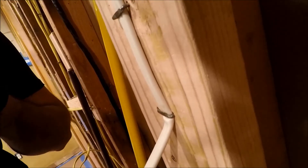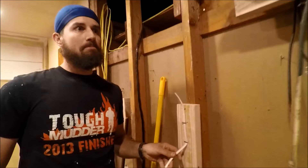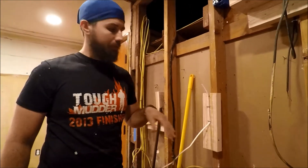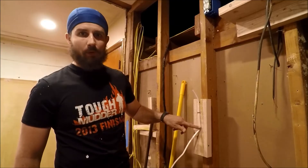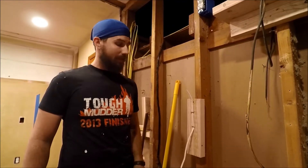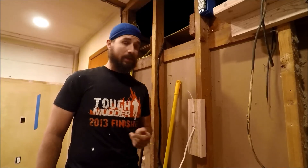What's really bad about this is it might not be an issue at first — it might become an issue in a week, in a month, or in a few years. As people go down there doing work, they move and bump the wire and it keeps wearing more and more through that little pinched space. So now with this nicely overdriven staple, we're going to see what it actually looks like when it does short out.